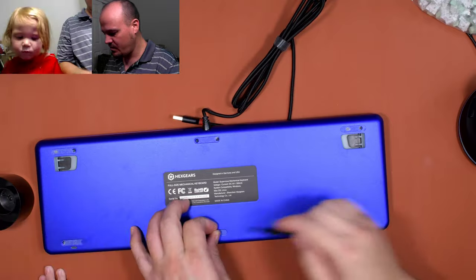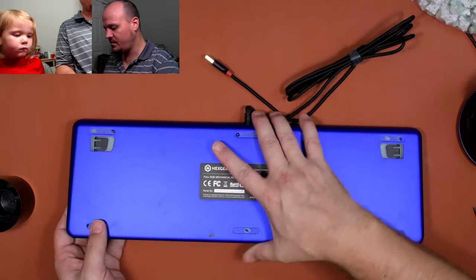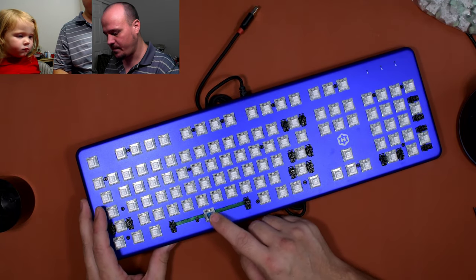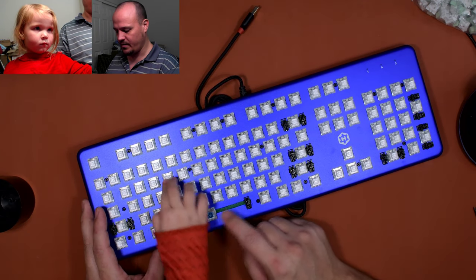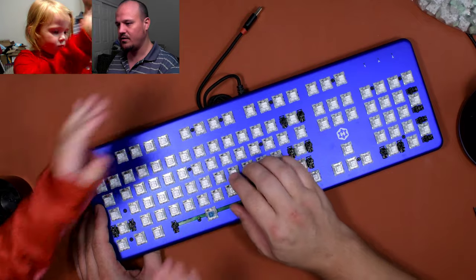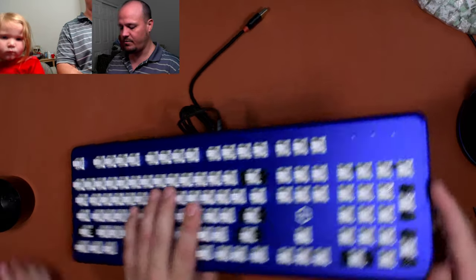So what we're going to do is leave some of the switches, like the modifiers, as Kailh Box Whites so that they're easier for your pinkies to press, to make it more ergonomic, like enter, spacebar. Oh, that's fun. They already went ahead and used a heavier switch for spacebar. Spacebar, we'll go ahead and keep it a heavier switch like they already did. But all the alphas and the numbers, all the alphanumeric keys, we'll make the heavier, louder Box Navies basically that we have.